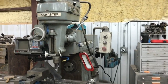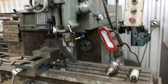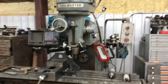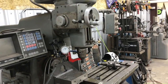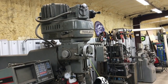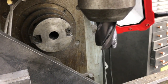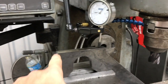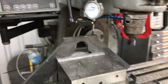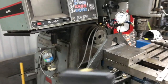I thought I'd make a quick milling video. I'm working on a larger project that I'll have a video up soon on, and we've been doing quite a bit of work on the mill. I thought I'd just make a video for those guys that might be interested in seeing this thing in action. We've got a one-inch short stubby end mill in there — should be a pretty rigid setup — and we've got to take about 90 thousandths off the surface here on this plasma cut piece.